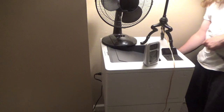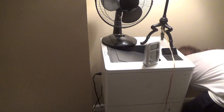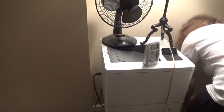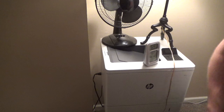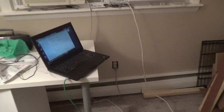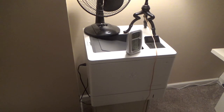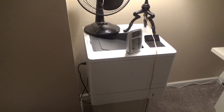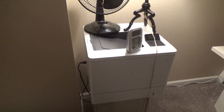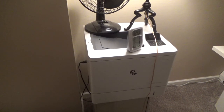The printer draws a lot of power so I'm not sure we can run that in conjunction with the air conditioning. There are a lot of electrical illegalities in this house. That outlet is a 20-amp outlet but I'm pretty sure the circuit is not 20 amps — it's probably only 15. So that's kind of deceiving. I'm going to have to change that outlet too, because you can't be plugging 20 amps into a 15-amp outlet. That's a recipe for disaster.